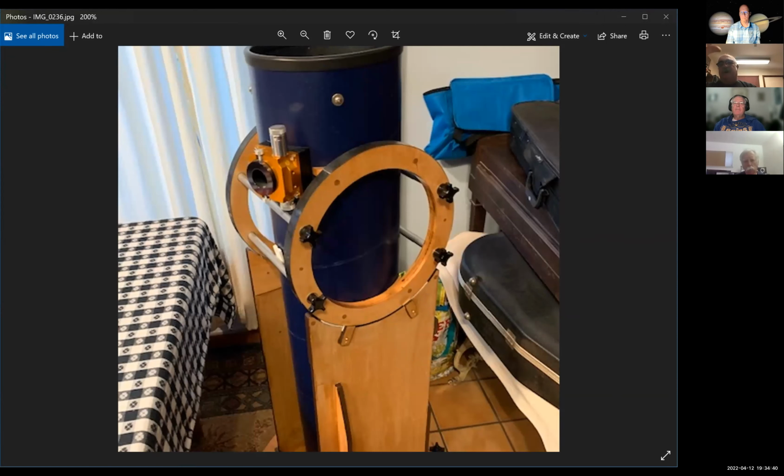What turns out is that the open part of the base where the tube is, when you slew the tube downward altitude wise, that open part is kind of a little flimsy. So what I did, you can see on the sides there, I put a vertical piece of wood just near the end, put the cursor down right there, that's it. And those vertical pieces of wood run all the way down to the base of the circle on the base. And that stiffened it quite a bit, but I don't think enough. I think it could have been really much stiffer.